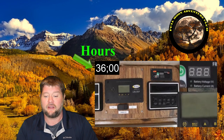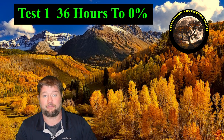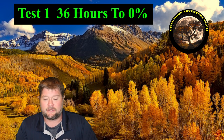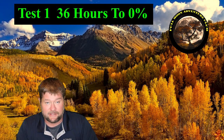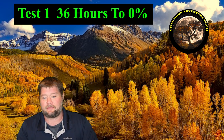At the end of this experiment we ended up with 36 hours almost on the money until they were completely dead and the lights went out. So if you cut that in half we have 18 hours to 50 percent if you want to compare those numbers to my other videos. At 50 percent about 18 hours, and 36 hours to completely dead. With lithium batteries you can discharge them all the way and then recharge them really fast — that's what they're designed to do. You can get thousands of cycles out of them taking them all the way dead and all the way back up, so that's a great feature about them as well.